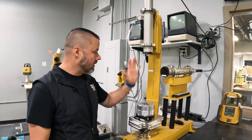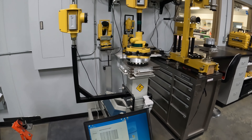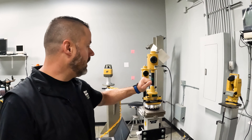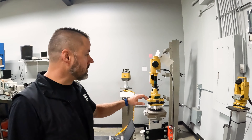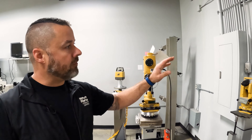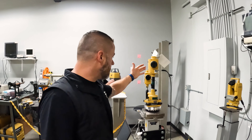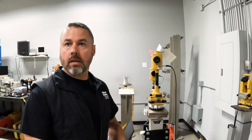This is our elevating collimator. Rob and I do a lot of total stations on here as well as lasers. We use the total stations for shooting different prisms, but mostly we use it for dual plane lasers or dual sloping lasers to get the elevation — like positive five, positive ten, negative ten, negative five — to make sure that the slope on the laser is good and dialed in. Rob uses it for millimeter also. This is the whole millimeter setup — he calibrates all the millimeter lasers for millimeter concrete, millimeter paving, things like that.